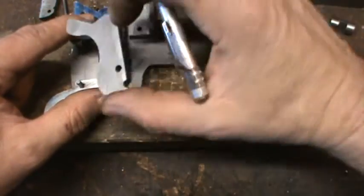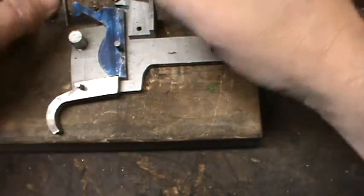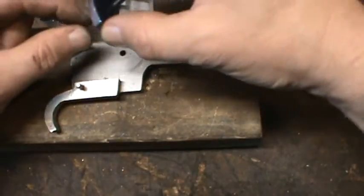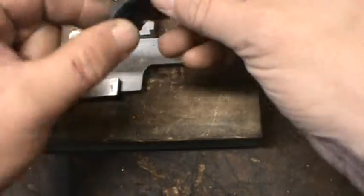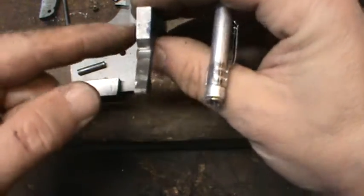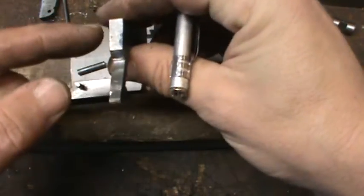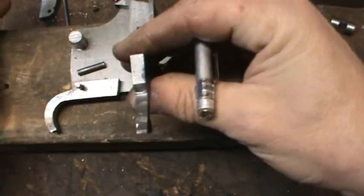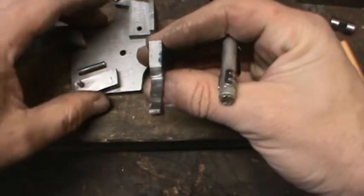With the original hammer I had no gap here. So I made another hammer, but I didn't have cold rolled — I had hot rolled — and it was slightly larger. So I tried to use the mill to thin it out. I thinned it out perfect on this side and way too much on this side. A drill press vise is not what to use on a mill, especially on a little mill like I have.